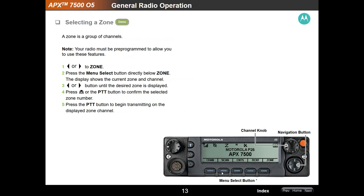Selecting a zone — it all depends on how it came from your vendor. In this case, the soft key on the right shows zone. Use your channel knob to move across the top — you can see your zone change: Motorola P25 will change to Region HIO, Missouri IO, Harrison County, VTAC Interops, Coded Squelch, and so on depending on your zone. Once you reach the zone you want, tap the home button, then navigate the channels or talk groups in that zone. Most of the time you'll be on VMed 28, HIO Call, ATMS 1, 2, or 3, or even VMed 29, depending on the situation and the incident communications plan — the ICS 205 — within our region.